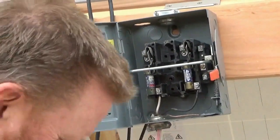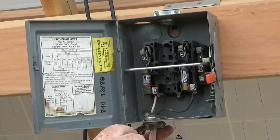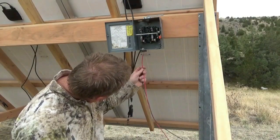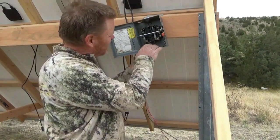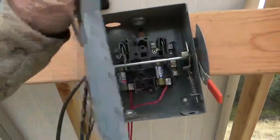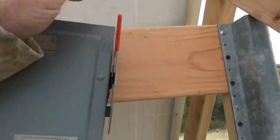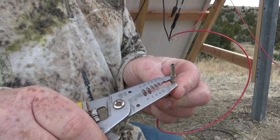Don't worry, I'm going to put another screw in this panel. Like everything, it was used, but it just happened to be perfect for what I'm using it for. With two 15-amp fuses, it should work just fine. The panels are rated at 7 amps at 35 open volts, and I'm using number 12 wire, so a 15-amp fuse should be just fine.